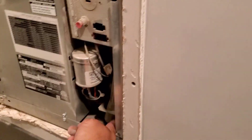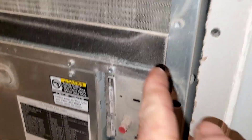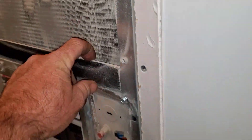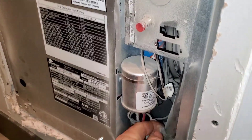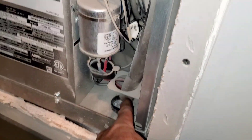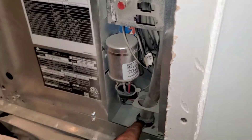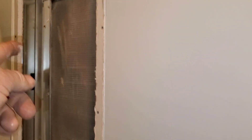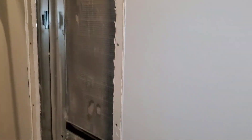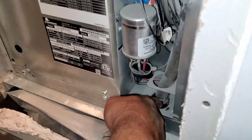This was actually even kind of short — it's supposed to be in that hole, and it ain't. The condensate pan is right here, and then it has a flex tube that just hangs here. It's supposed to be run down into that. If somebody pulls this unit out too far, it pinches that line and blocks it off. If you run the screws too hard on that outer cover, it'll pull this unit out and also pull your condensate hose out. This hose is too short — you can't pull it down.